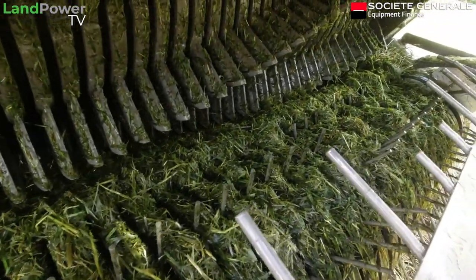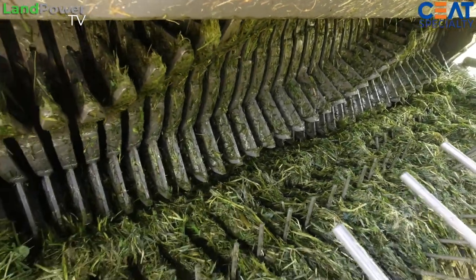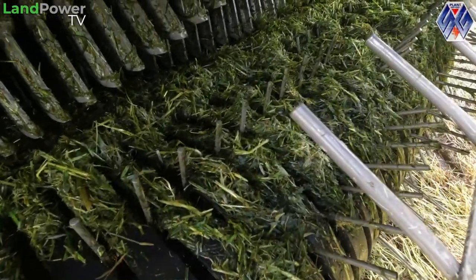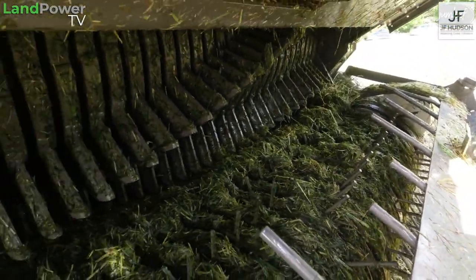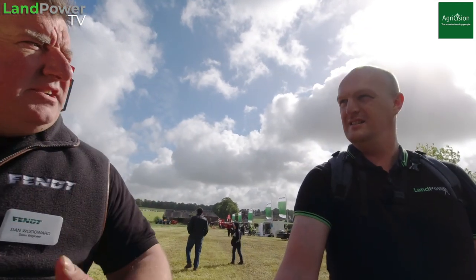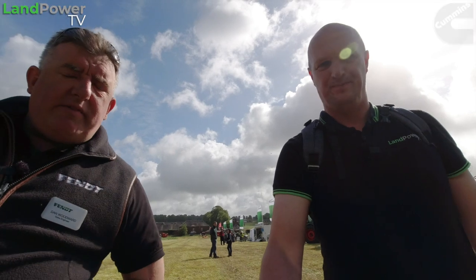You're now looking at the Hardox rotor on that. And also you've got the camless pickup. And you can also see here, you've got plastic tine bands on that side. There's a couple of advantages of the plastic tine bands. They're a lot quieter. They're also flat, so you don't get any soil build up on the actual tine bands themselves. And also, if you do hit anything with them, they come back into shape. So they just flex back. There's no issues with them at all on that side. And like I say, it's a camless pickup on this, is it? Camless pickup with seven rows of tines.